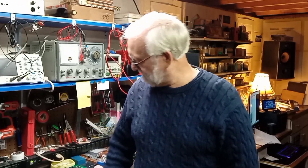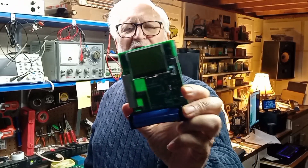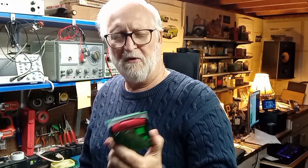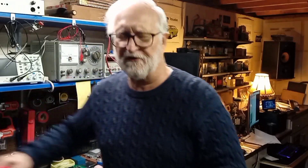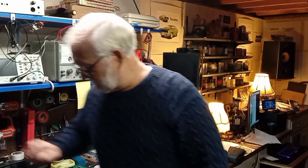So I got one of these little battery testers. It puts a 500 milliamp load on a full battery and tells you how many milliamp hours are there. Most of those old batteries came out at about 2100–2200 milliamp hours, but they wouldn't perform in a discharge test because they're old and they've been used. Even though at 500 milliamps they seemed okay, when you crank them up around an amp the runtime just wasn't there. For low-current applications they're still good batteries.